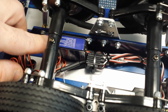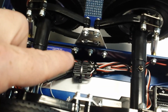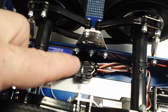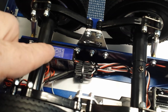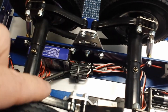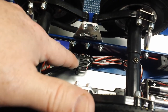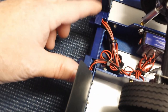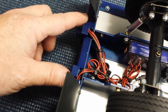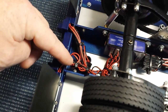Not all the functionality is in the Tamiya light controller, and there's no return signal. Normally you'd have this plugged into the receiver and then out to a servo or speed control - it gets the signal first and then sends it out. For the unused outputs I just tied them off; I didn't want to cut them, just bundled everything up and tucked it underneath nice and tidy.